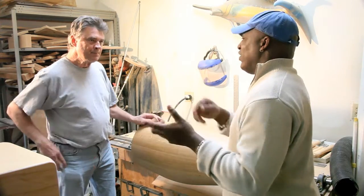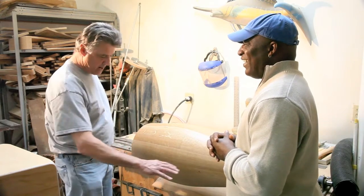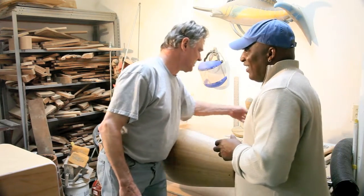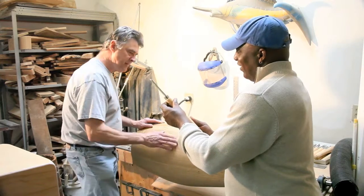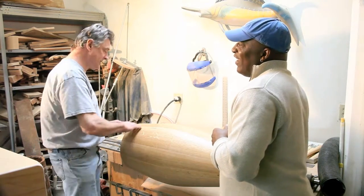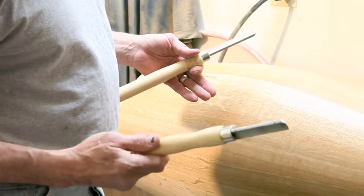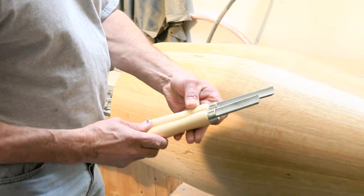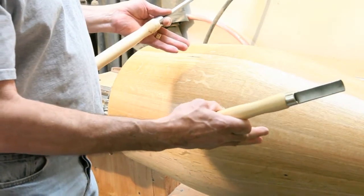And so when you are turning the lathe, are you sanding down at this particular time, or what part are you on the job? We cut. I have a couple of tool rests that I put here, and we cut with various shaping tools. And once the drum is rough shaped, would this be one of the tools? That's a scraper, yeah. So that takes out some of the scratches. And then the final shape is done with sanding blocks. And that gets this section truly flat, this section truly flat. My favorite tool for shaping is this one. It's just my basic workhorse utilitarian cutting tool. I use it so much. It started out that long, and we've sharpened off that much. I sharpen this thing about a dozen times in the course of turning one drum.